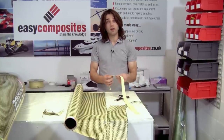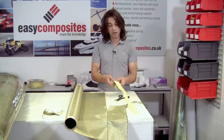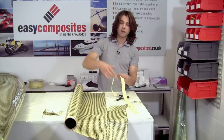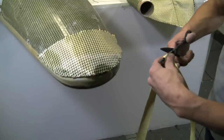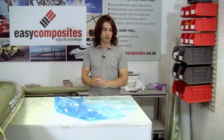We're now going to be using a Kevlar flat braid, which is commonly used around the edge of the kayak for joining the upper and lower hulls. We're just going to be using it around that front area where we've got the damage to the original braid. This is release film — it's a very thin, fairly stretchy film designed not to stick to resin. Once we've done the repair over the front, we're going to stretch it over the repair to give it a nice smooth, even finish.